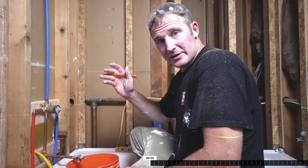It's up like here up north. You're going to end up having shrinkage and expansion and contraction of that wall, causing cracks in your grout joints. And obviously it's going to feel cold or hot depending on the time of year. So unless you have like a 2x8 outside wall of some sort or your frame on the inside, you really mostly don't want to go in an exterior wall. You want to be doing them on the inside. So this location that I'm going to be installing one on this tub does make a lot of sense. It's actually very convenient. You'll see the reasons why here shortly.